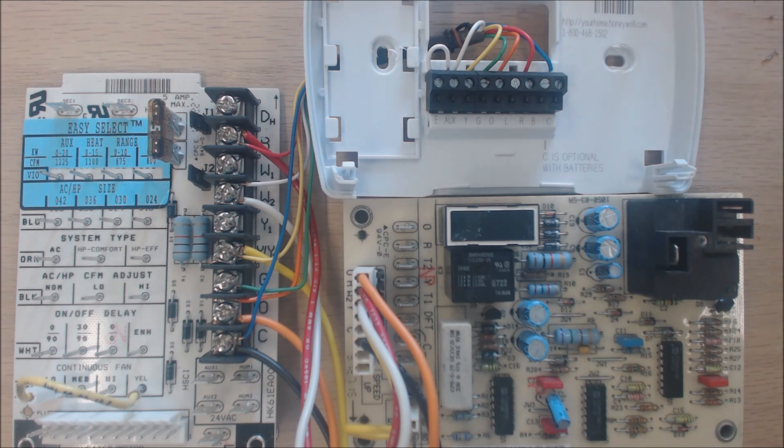This thermostat is mainly used for air handlers — the same as a fan coil — that have a heat pump attached with electric strip heating, in which case you'll just have these two jumpers. This board in the outdoor heat pump is for defrosting. It can also monitor the high pressure switch, low pressure switch, high temperature switch, a defrost temp sensor, has a timer, a diagnostic speed-up terminal, and it allows power through to the outdoor fan motor via a relay block.